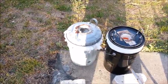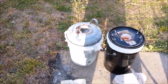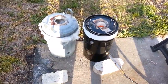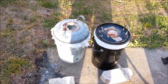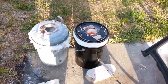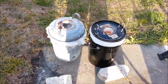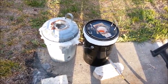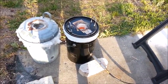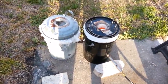What am I going to do with the old foundry? Probably beat out my homemade refractory insulation, get rid of the torn-up ceramic fiber, and rebuild it like this one. Then I'll have two foundries — and I have two burners. What I might use one for is as a burnout furnace for molds while I'm melting metal in the other, so I'll have a hot mold to pour the hot metal into. It was really simple and quick to build this second foundry, and it should be really simple to rebuild the first one.